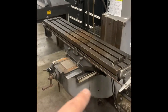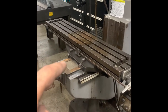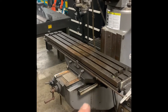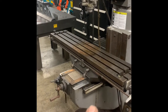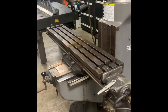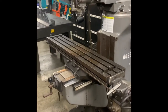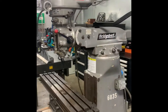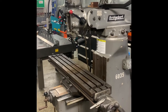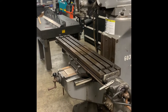I'm going to take the table off, take the saddle off, take the knee plates off, and blow the inside of the knee out. On a service job, I do not remove the knee from the column — that stays assembled and just gets cleaned up. This is a service job, not a rebuild. This is just what every machine gets when it's serviced here at Machine Tools Rebuilt. Stay tuned — I'll take more pictures and video as I disassemble and reassemble it.